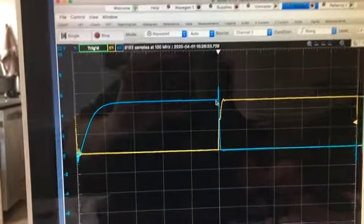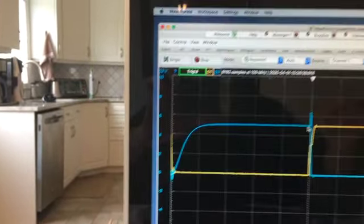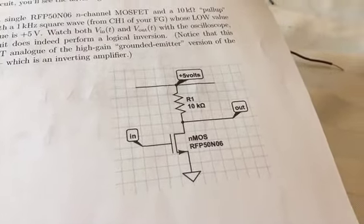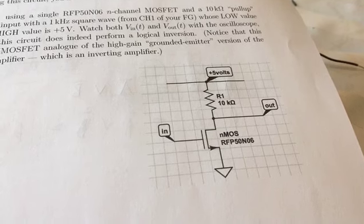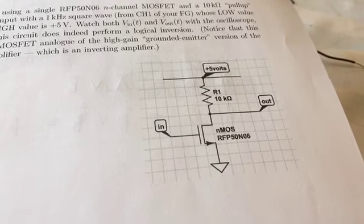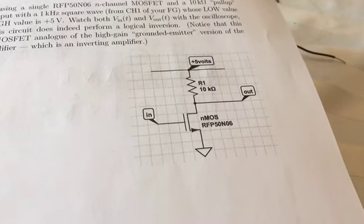So that's why you get the very different time constants for going down from 5 volts to 0 versus going up from 0 to 5 volts. So NMOS logic using just a single kind of MOSFET is known to be pretty slow, because you have this effect that things going from 0 up to 1 have to charge through a resistor. So we'll see that CMOS logic is quite a bit faster than NMOS logic.